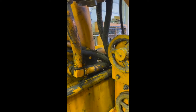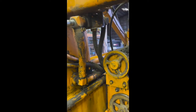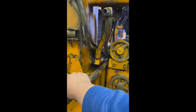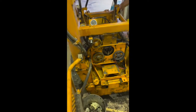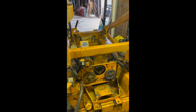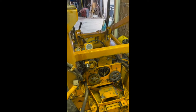I wish there was a shutoff to take the hydraulic oil filter off, because when I first started cranking that out, it was pouring out of there. And so I went ahead and drained the hydraulic reservoirs on each corner post here. Which I'm not really regretting right now, because we've decided we're going to get the new motor ordered and installed, just to run through the hydraulics. Make sure everything's working pretty good. Good enough to know that it doesn't need rebuilt or replaced before we go ahead and then pull that motor out.